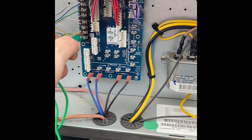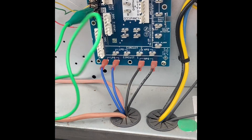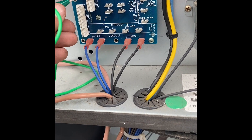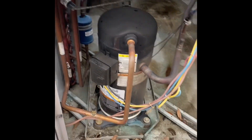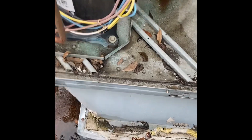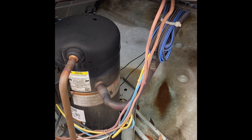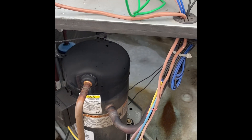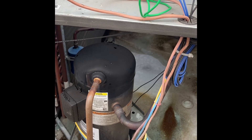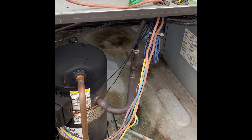At this point we definitely got the heat figured out. I let it run for about 15-20 minutes and she ran. I wanted to see that compressor though. I've already checked the service ports and it doesn't have a lot of pressure in it — I did put my gauges on to verify. But she came on and it definitely went out. Is that a short cycle? It must be. I poke around on it for a little while longer and it's definitely short cycling.